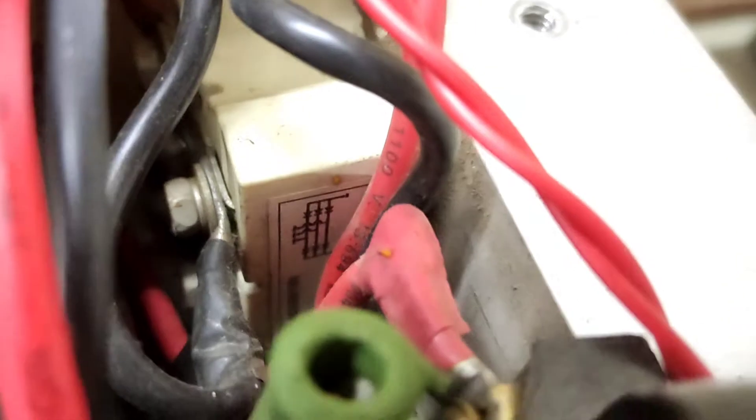Or anything basically with a huge capacitor in it. This thing that you're seeing right now is a full bridge rectifier. This one is actually designed for three-phase application — it's a 100 amp capable full bridge rectifier. The whole setup is designed as a very high current rectifier intended for specialist applications. The white thing is just the rectifier block; two of the connections go straight to the AC mains and the other two will be the DC output.